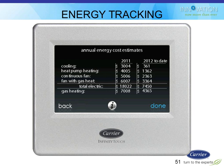And you want to include everything that represents that. So not just the cost of the actual gas, but all the delivery charges and the account fees and taxes and whatever else they stick on your bill, and average it all out. So for right now, use 11 cents a kilowatt hour and use 80 cents a therm. And then every year if you want, we can tweak those and let me know. I'll tell you what the new best guess is.